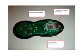So what's going on here? There's obviously the microcontroller taking care of business. It's the one that sets up the protocol, talks to the transmitter chip. It's going to prep everything up and send it out. There's a serial EEPROM. That must hold authentication data. Even if it's just one-way traffic, it'll be maybe a serial number or maybe some kind of shared key that does not get hashed, because when we look at this chipset later, it's only one way. It's not a transceiver. It's transmit only. So anytime you're transmitting only, if I'm talking across the room and I can't hear back, there's no questions, anyone can repeat what I'm saying. So right off the bat, we have replay attacks.